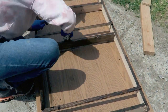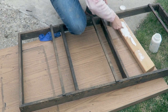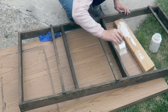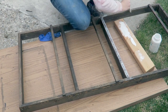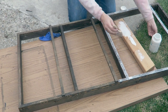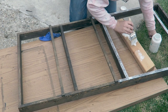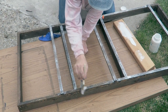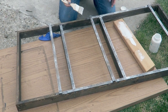In the inspiration picture it's just kind of a solid white, so I wanted mostly white but also wanted the stain to come through. Once I stained it and let that dry, I went in with a chippy brush and some Waverly white chalk paint and just gave it a very rough coating — like a dry brush — and then went back over it again with a very heavy hand. Honestly it really does look white, but when you get up close you see just a little bit of that dark peeking through, which is exactly what I wanted — a very rustic farmhouse style look.